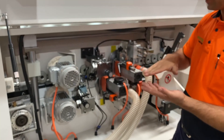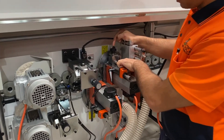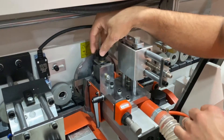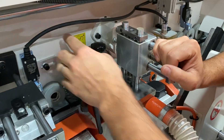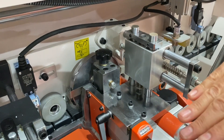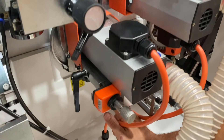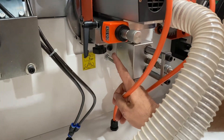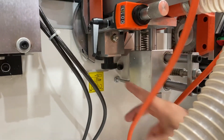Height adjustments on how close it cuts to the panel can be adjusted by this knob here. Loosen off this 13mm nut and adjust up or down — that will move the tracer. You can see the little picture which shows you which way to go; it'll make it cut closer into the panel or further away. Remember to lock that nut up. On the bottom it's exactly the same, just the opposite way around — lock nut and then adjustment.